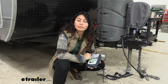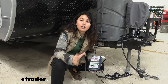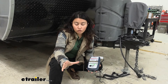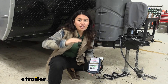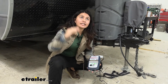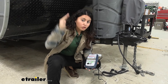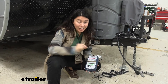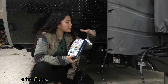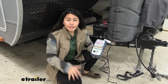We're now at step eight, the final step. The green light means battery health is good. This is the maintain step — for a 12 volt battery you'll have a float charge at around 20 degrees Celsius. For a 24 volt battery you'll also have optimum charge health with an adjusted temperature. If battery health drops below 90 percent, that light turns off indicating the battery is not at optimum health. During step eight, a low current pulse is continuously delivered to help prevent sulfation, extending your battery's life and power.